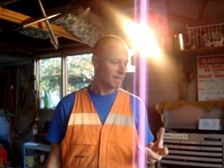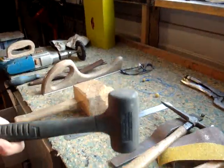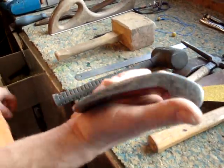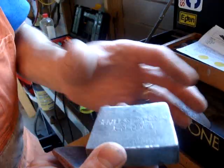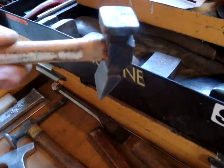Number two: tools. Got out the tools of the trade. I've been collecting these for 15 years. My dad was a panel beater before this, a body shop man. You need a flat face panel hammer, a return sweep panel hammer. Dead blow mallets are really handy for pushing and tapping things out. A wooden mallet is essential for aligning edges. There's lots of dollies — this is my favourite, it's called a Comet dolly. Some of the best dollies are ones you can make. This one's really excellent for Vespa and Lambretta work because it follows those edges and contours — bent and made exactly for that. The best hammer I own is an old cobbler's or shoemaker's hammer, with an excellent angle and edge for tucking. The square face — it used to be round, I cut it square with a disc grinder — and that's used for getting into long edges or swages.